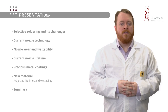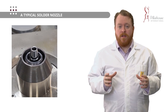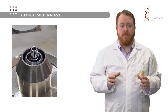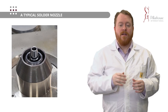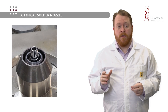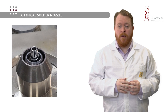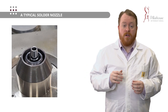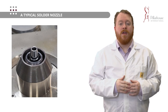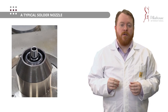What you'll see here is a photograph of a Selective Soldering Nozzle with its Inert Shroud at the bottom. This is used to keep an oxide layer from forming on the outside of the nozzle, and you'll see a nice shiny tin layer from the solder that has adhered to the nozzle — it's still in liquid form. This photograph was taken quite soon after the solder flow was stopped. Around the circumference of the nozzle we require the solder to wet all around so that we get a nice radial wave, which gives us control during the Selective Soldering process.